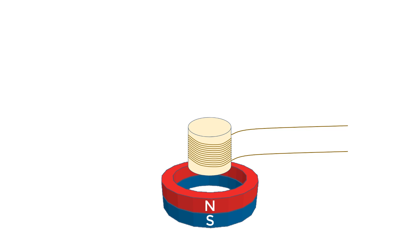We start with a permanent magnet that's in a tube or donut shape. We have one side that's north and the other that's south. We put a coil of wire around another tube or rod. Together, this coil and rod are known as a voice coil, and they move independently in and out of the magnet's hole. When we put an electric current through the wires on the voice coil, we create an electromagnet. One side will be north, and the other will be south, just like our permanent magnet.